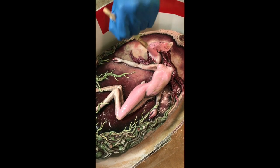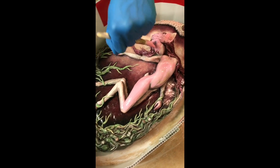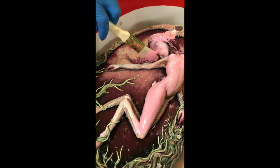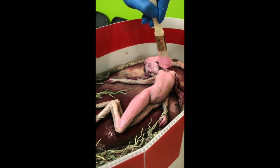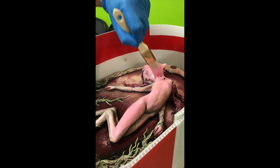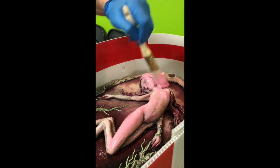We lose a lot of detail from the undercuts, but all this area around the eyes is very important. Make sure there are no eyeball bubbles — that will cause trouble. I'll paint this on real dry. All that in the lips, make sure that gets captured. All that hair detail — very detailed hair. We might lose some of this hair when the mold comes out, so I'm going to do my best to get as much detail as possible and make sure no bubbles are trapped.